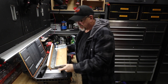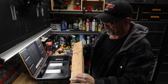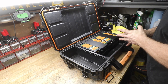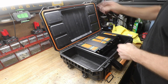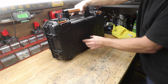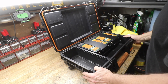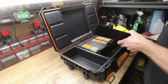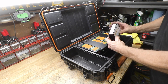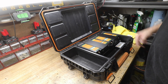So this is what I have so far. I built a simple little tray using roofing nails — they have the flattest heads — and pounded them over on the back side. It's a little crude but nobody's ever going to see it. I powder coated everything, made it look nice, painted the tray, bolted everything down using nice little black steel stud screws through the case, through the strap, into the plywood — three on each side. Not going anywhere. While I was waiting for the powder coating to cool, I cut a nice chunk of aluminum to go right there under the charge controller.